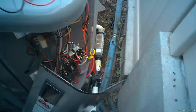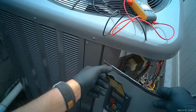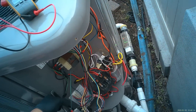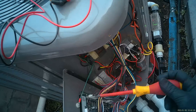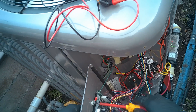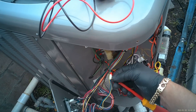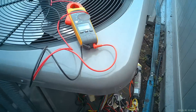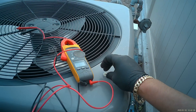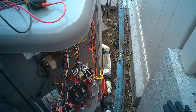I removed the front cover which contains the control panel. It's a bad design because we have no real room here to play. It may be a good idea to remove this ground wire so you have a little more flexibility with the wiring here — still not that much more, but something's better than nothing. Since we have the breaker tripping immediately upon compressor start, what we want to check for are shorts to ground.